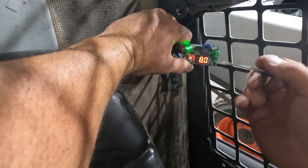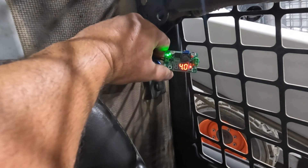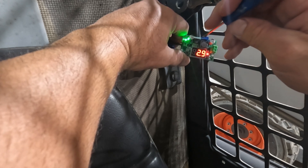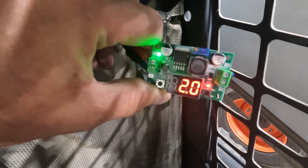Now let's test on the G-series with a different controller. The incoming voltage is 8 volts, and our outgoing is set to 4 volts as mentioned in the post — but at 4 volts the seat bar light is not on. Bringing it down: at 3 volts, still nothing. At 2.6 volts — the light actually came on. Taking it down to 2 volts — there it is, seat bar light is on and the seat bar is in the up position. So the G-series wants 2 volts feedback, while the F-series wants 6 volts feedback. Different series machines, different controllers, different voltages.